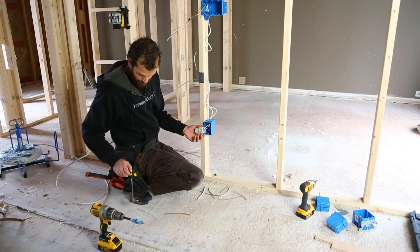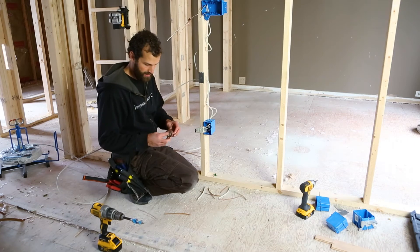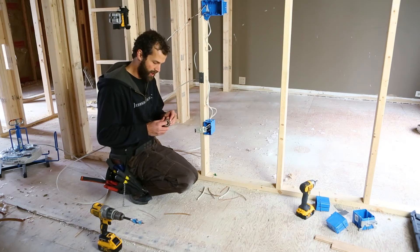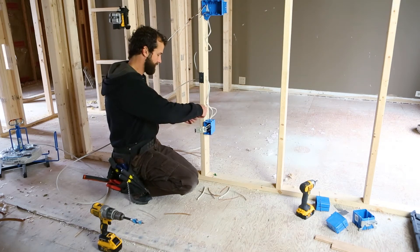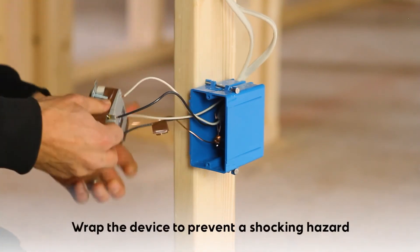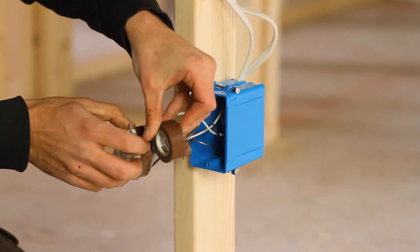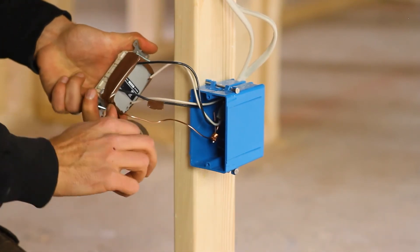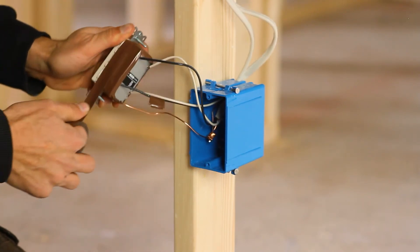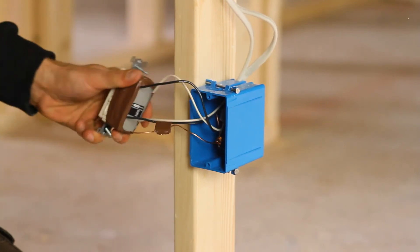Because this is temporary use, this box will not be fitted with an electrical plate — that plate would impede the installation of drywall finishing and paint. So I'm gonna take electrical tape and wrap the device securely to insulate the terminals. A total of three wraps of electrical tape to prevent shock hazard to anyone who comes after me. I'm gonna leave my screws free.